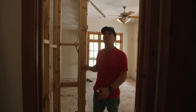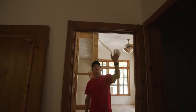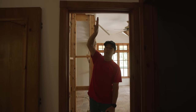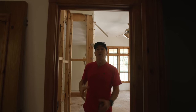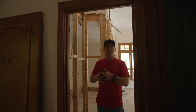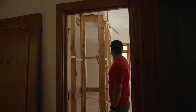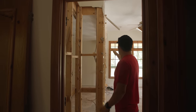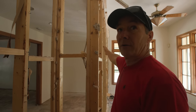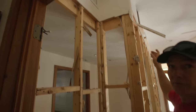What about this post? This is getting framed out — this door will be no more. We're going to frame this out and because this wall intersects right where this doorway is, rather than all two-bys, we'll be putting in a four-by-four post, and that's what the beam will set on. I'll pull that drywall, put a post where this wall currently ties into that wall, and the beam will sit on both those posts.